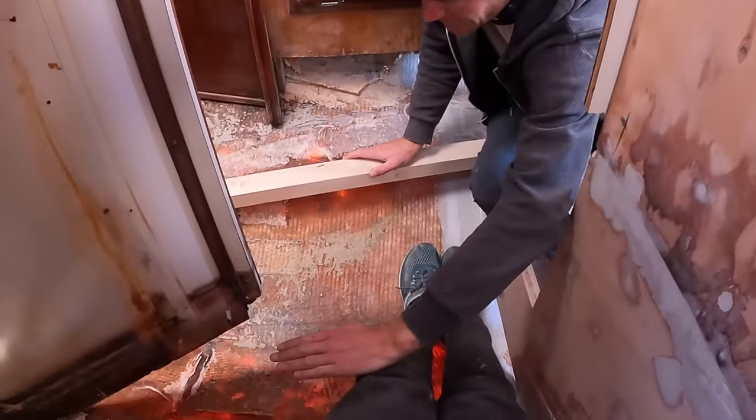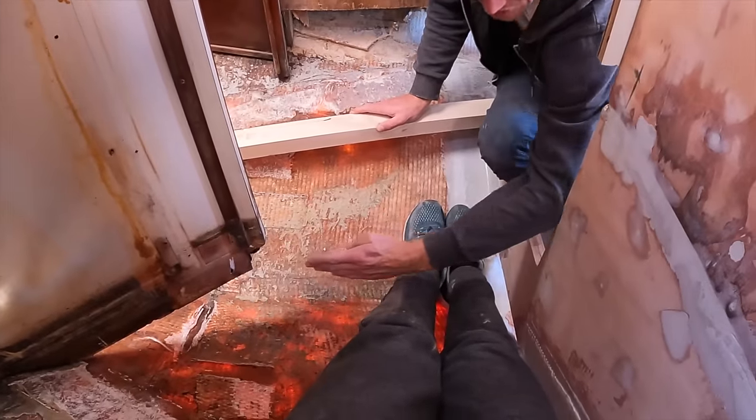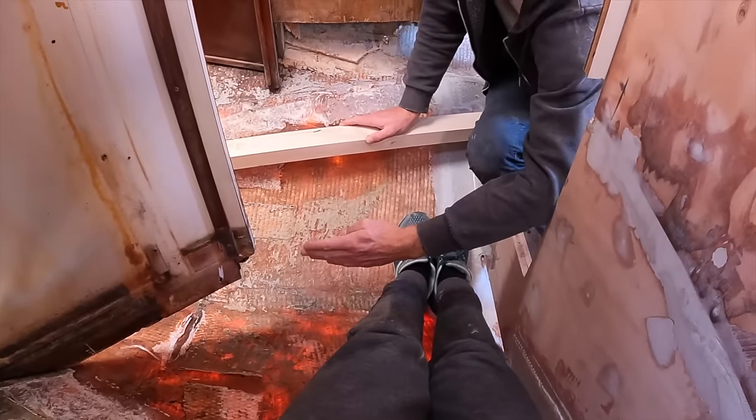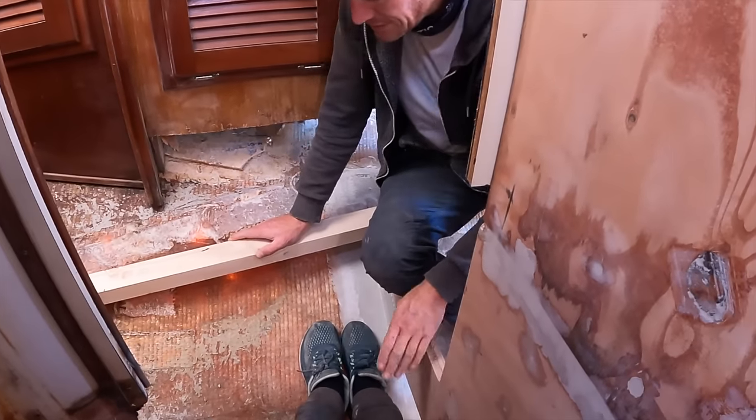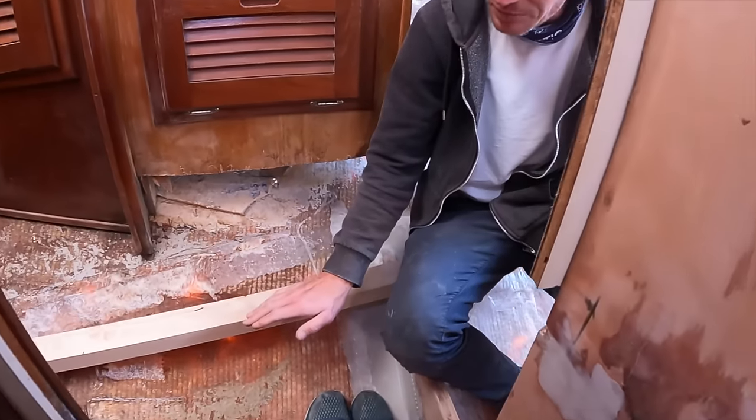I have maybe another hour and a half's worth of work to clean the old tabbing, because we're going to do a triple bulkhead here - or a triple rib - which is quite small, just to strengthen up the forward part of the boat. One piece of floor will have to go in here, finish at the threshold, and all the way to the front. Here will be a joist, and then the next piece can go on top.